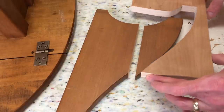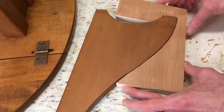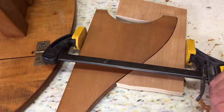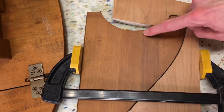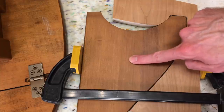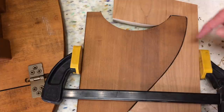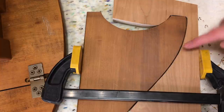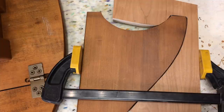With this piece cut out, I can nest it around here, hold this in place, and let's give it a test. Put a clamp on, give it a squeeze. This is where the seam is, and the vector clamping is providing pressure this way. Because the pressure from clamps radiates at a 45-degree angle, this clamp is providing pressure well beyond this break point here and well beyond this break point down here. So I only need one clamp to hold all this together.